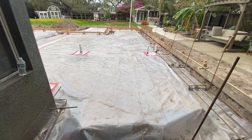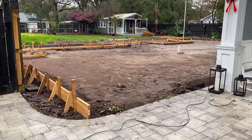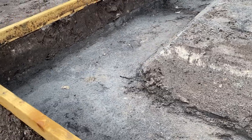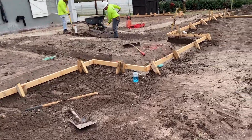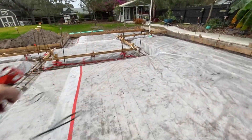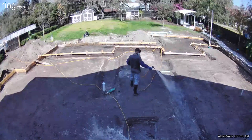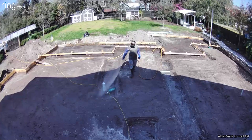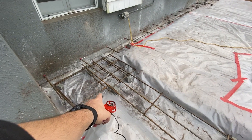Welcome back to the channel. Today's a big day — we've been out here all week long working on this foundation, getting the footings dug, prepared, and ready for concrete. All the perimeter and interior footings are ready to go, the slab is covered in moisture barrier plastic, it's been termite treated, and today we passed the inspection. Now we pour concrete — it's as simple as that, and it's very exciting.